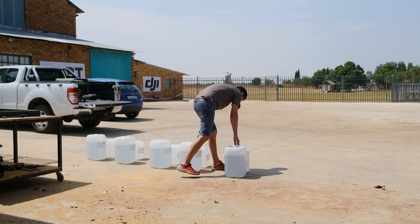Starting the casting process, we're using a deep casting epoxy called Crystal 100. We don't do deep castings in a single pour for multiple reasons. For a table 70mm thick, we ended up doing three casting layers. This reduces bubbles and gives a lot of working time — once mixed, we can leave it in the bucket for around half an hour. You'll see most air bubbles rise up, giving you a chance to pop them before your first casting.